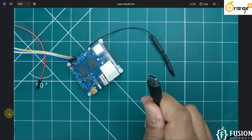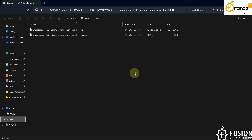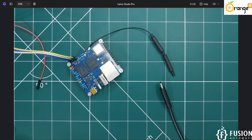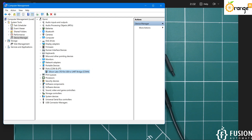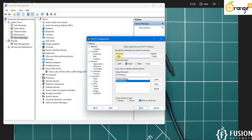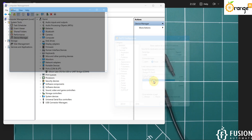To power up, first open My PC, go to Manage, then Device Manager. Expand the Ports section and you can see the USB-to-TTL converter connected on COM4. Now open PuTTY software, select Serial, enter COM4 as the serial line, and set the speed to 115200. Save this session as Orange Pi 03 and double-click to connect.